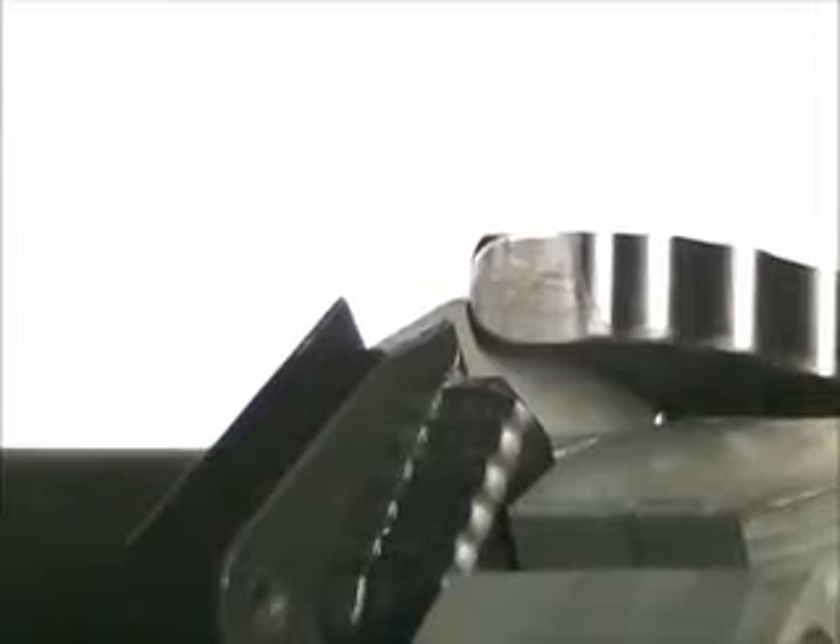Here you can see I've really flattened out the tip of that flip ramp so that it's quite low, almost a sharp edge. You don't want a blunt edge there because the bullets will hit that blunt edge and then they'll get wrenched out of the collator plate.